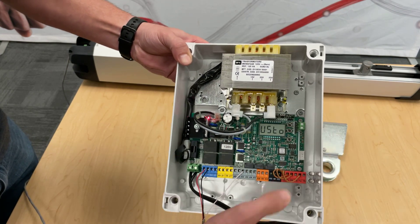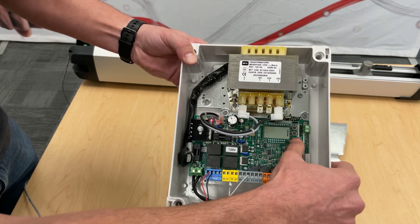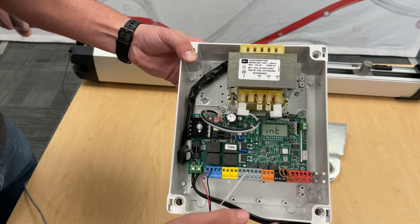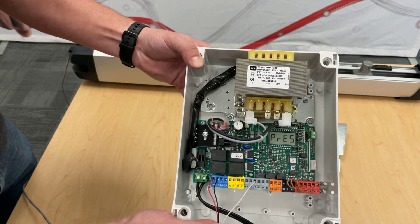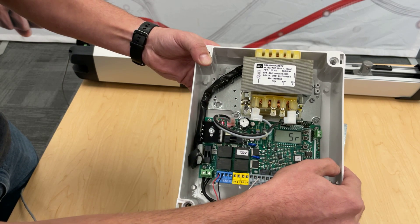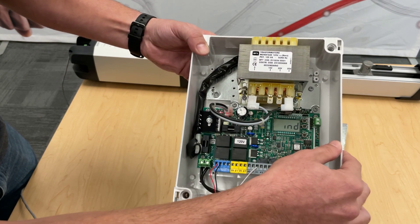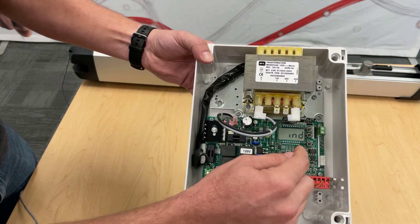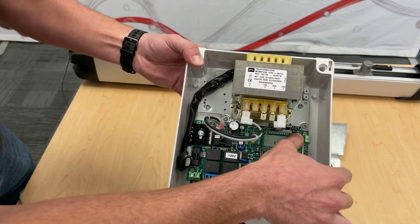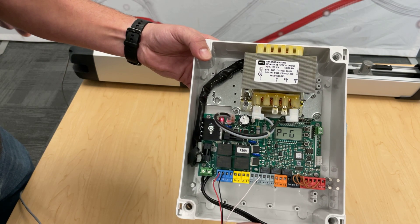For this demo we'll choose Krustos/Phobos and push OK. It will ask the number of motors — we only have one, so push OK. For direction, choose INT (internal) or EXT (external); we'll keep it on INT. Then for presets: AR is automatic residential, SR is semi-automatic residential, AC is automatic commercial, SC is semi-automatic commercial, and IMD is dead-man switch — remember to switch away from IMD or it will only work while you're holding the button. We'll select AR and push OK.